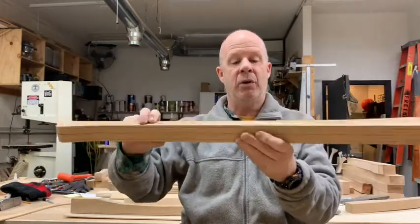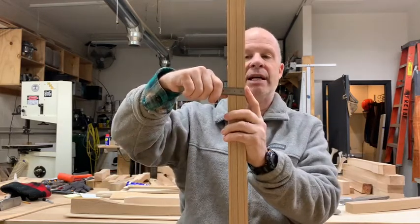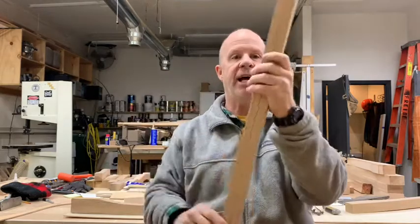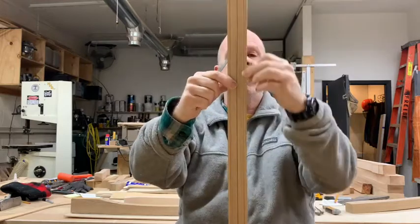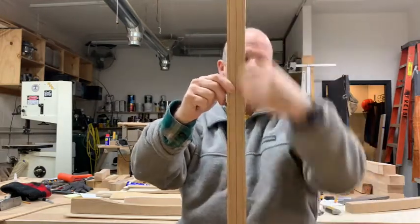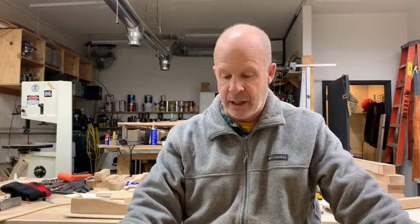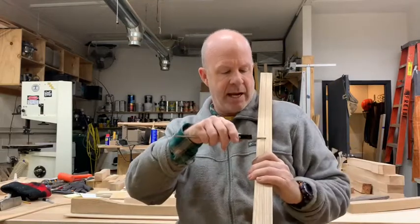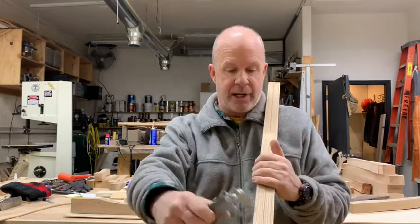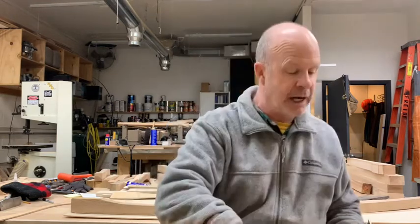the contour. In other words, if I were to pull off of the edge with a board that isn't jointed flat, in other words, if this board has a hook in it, your center line or your side of the axe handle is going to follow the crook in the handle blank. So that's what the center line is eliminating. Basically what I do is I just look where the center of the board is and I guess where it would be with the lines already on it.